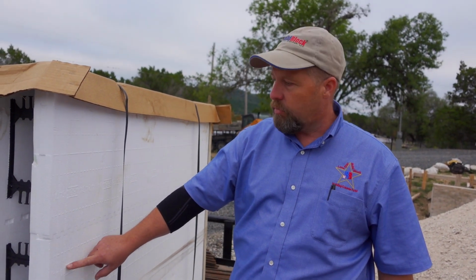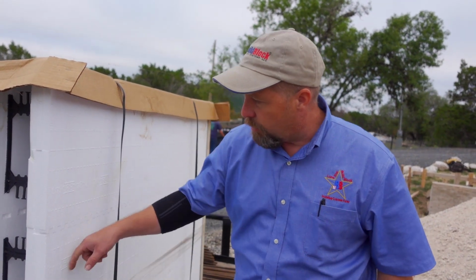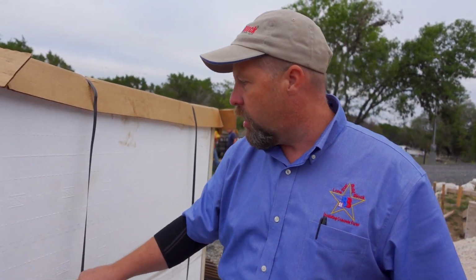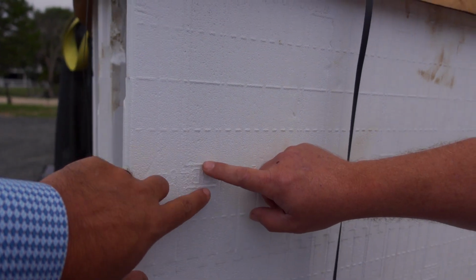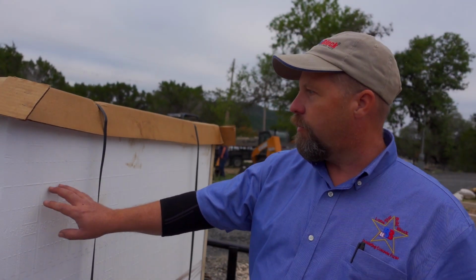Wow. Okay. So if you have something heavy duty on the wall and you want to make sure to hit it, you can measure up from the floor. Every 6 inches you're going to have one of these marks. So these marks are the 400 pound? Correct. That mark is a 400 pound pullout. So the rest of these marks on the block are just for ease of installation. Okay. We don't necessarily need to use a tape measure.